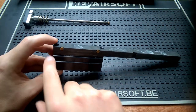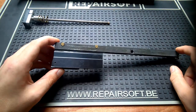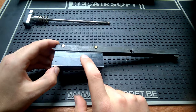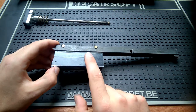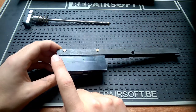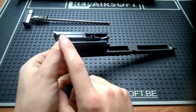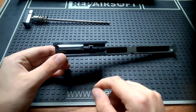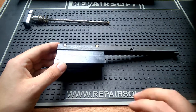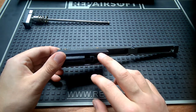After that, I used my Ratek top carrier that I already had and bought an Angry Gun SCAR-H bolt carrier. Why the SCAR-H? I knew I was going to make a semi-only gun, so the full-auto sear on the back wasn't needed. The dimensions of the SCAR-L and SCAR-H bolt carrier were exactly the same, except for this extra nub — the full-auto sear on the back. So I knew I could use SCAR-H bolt carriers.